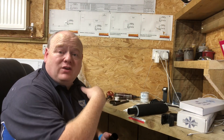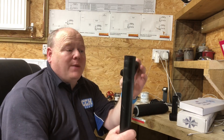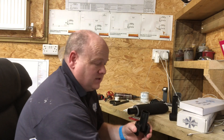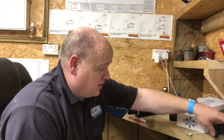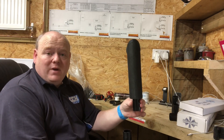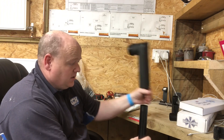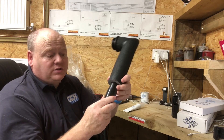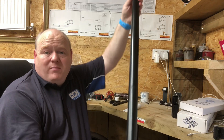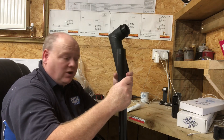I'm just going to connect some of this together and show you how I use it. These cutters for plastic are absolutely brilliant - I've had them a long time now so the blades are probably not as sharp as they used to be, but they still work perfectly. You've got your pipe coming out of your wall - you supply your own waste pipe, get your socket, glue your socket on there, and if you can get to the pipe at the bottom you can just glue that on. If not, just pull it off until you put the insulation on.